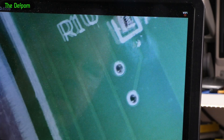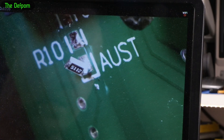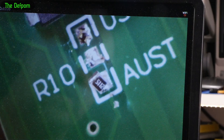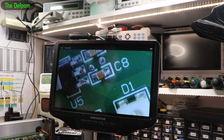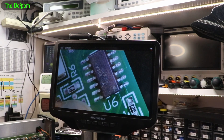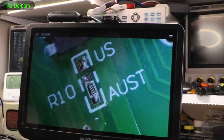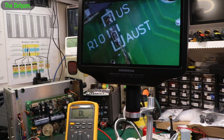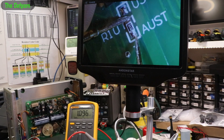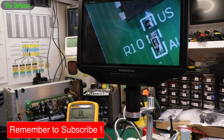See that? It's like it's cracked — I just touched one end and it moved, and that shouldn't happen. I already tested the value and made sure it's reading OK in circuit, so the value seems okay, but maybe this wasn't soldered very well — that could be the problem. I've reflowed absolutely everything: all the RF stuff, the actual IC, all the circuitry up here, and this level shifter as well. I believe the issue was that resistor. I don't trust it — I think it's actually corroded on the end. One probe on that end of the resistor gives 1.1 meg to the pad, but going to the resistor end gives 67k. It's bad.